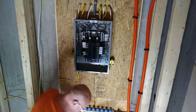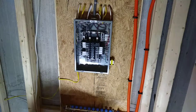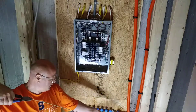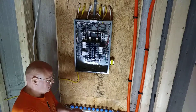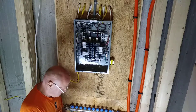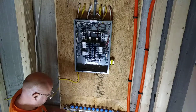We'll make our tear right here — when I just rip the Romex like this, I don't risk cutting into an insulated conductor, so that's why I do it this way. Get everything all off there nice and clean.